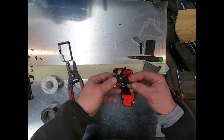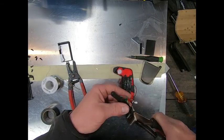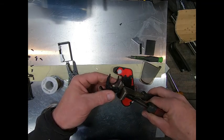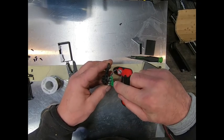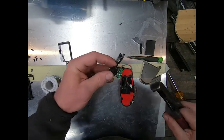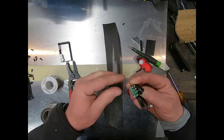Now for the trigger — the trigger is too large to fit in this spot, so we've got to trim this part off and trim the back side off too. Back to the horseshoe pliers: come right in here, give it a trim, trim the other side, and corner off the edges a little bit. Also on the circuit board, this dead area where there are no circuits — we're going to take that off as well. Come right up to the edge of the circuit, give it a chop, then come back with the emery cloth and smooth it down.